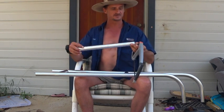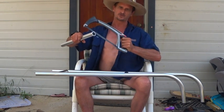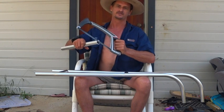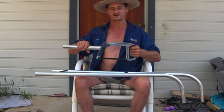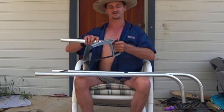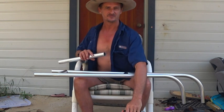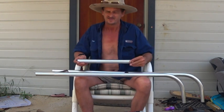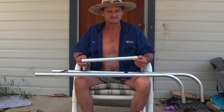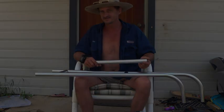When you're cutting backwards through aluminium it's a lot smoother — a lot smoother cut than trying to hack through it the normal way. If you hack through it you'll end up with a billion burrs around it and you might get a wobbly cut too. A lot of people probably already know that, but yeah, give it a shot anyway.